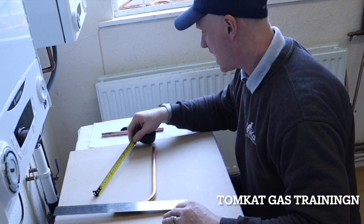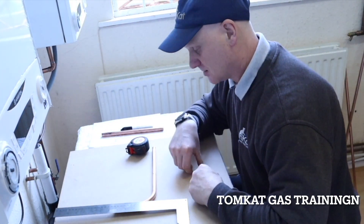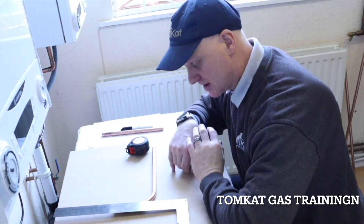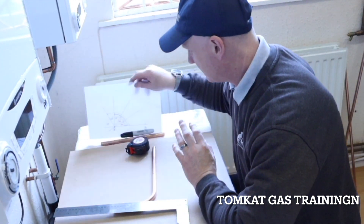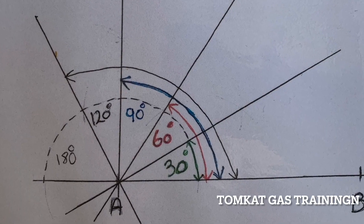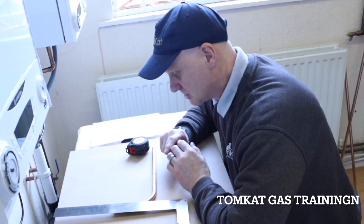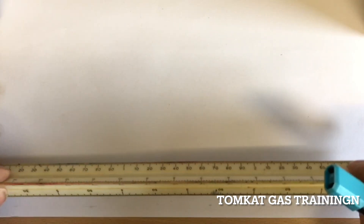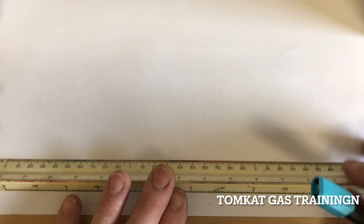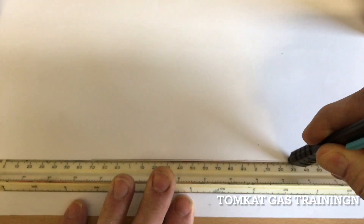Around about 135mm is the minimum double offset I can make, and this is why we have to do offset bends to get us closer than that distance. So let's look at actually producing this little reference table I've made, which will help us work out the angles for these bends before we start producing offsets. Let's look at making these angles.